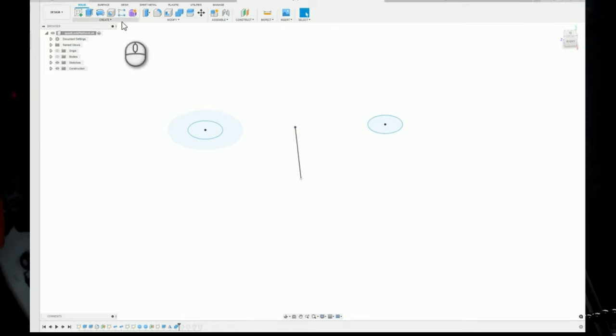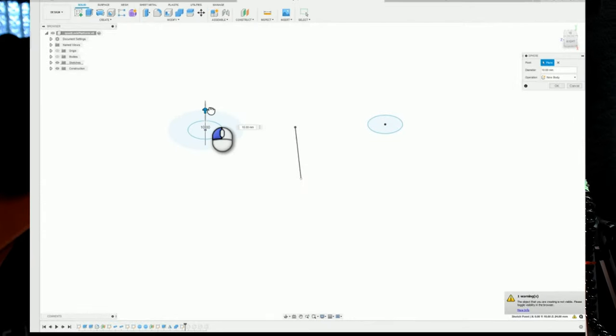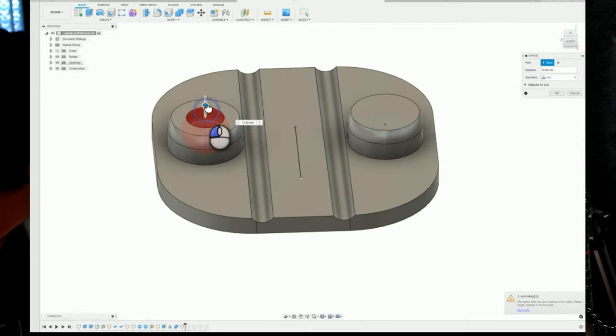We have these sketches available. I had 12mm spheres. I think that in the one that was functioning it was pretty tight, but that was probably just because of contraction partially because of how thin that wall layer was. You gotta be careful with diameter because it almost compounds faster than you would intuitively think. Because the PETG can stretch a little bit since it is pretty ductile, we're going to go for 11.25mm diameter.